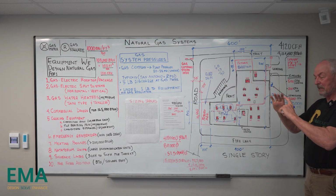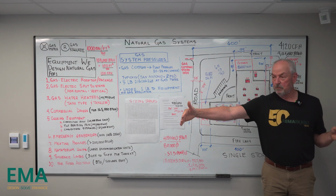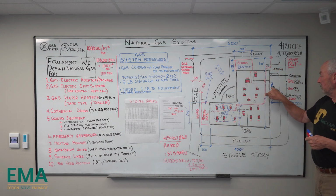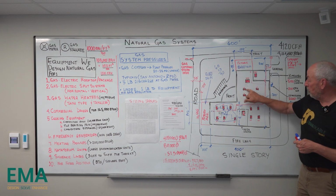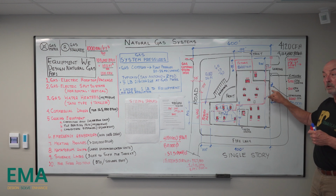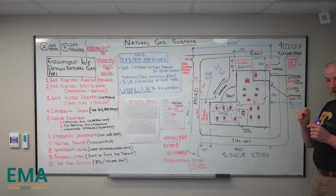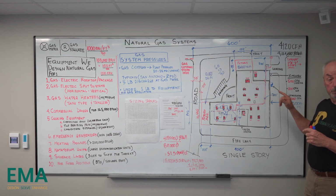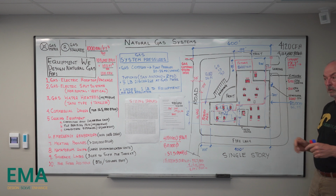So we want it to be 6 inches for 10 feet for that size generator, because we've experienced the same thing if we put these two together. They can't run it at 100% because there's not enough volume. And so we've gone back and modified our detail for that so that we guarantee that we have enough volume, but we've got to make sure that detail's on the drawings.